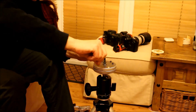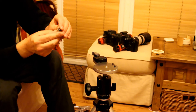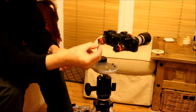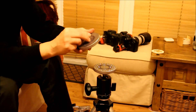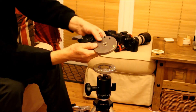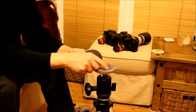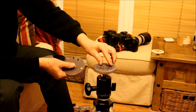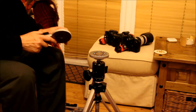I'll remove this to show you what's underneath. There are two cup washers here, with the cup dish sides facing away from each other. A shoulder screw with a nice surface on it. There is a ball race that fits in here — a nice fit. That goes through and mounts in here. In here there's a recess in the bottom plate for a thrust bearing, which sits in the bottom of there. And there are two rows of indents, as you can see now — one row and another row.